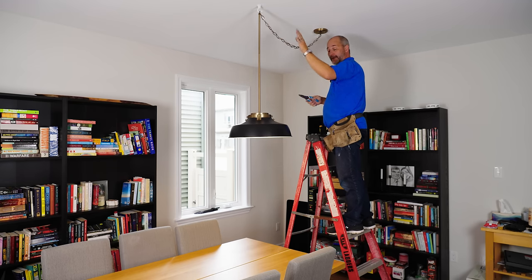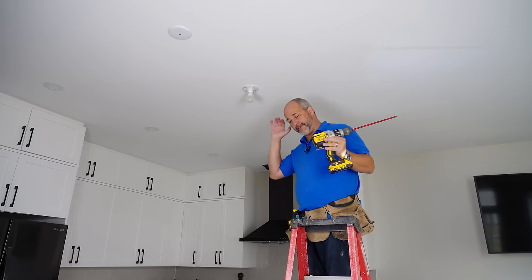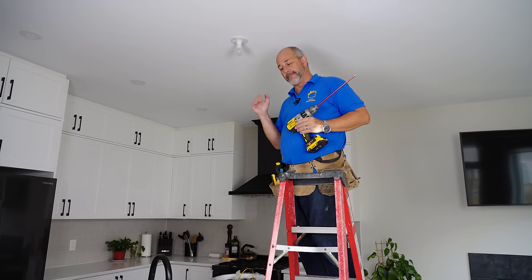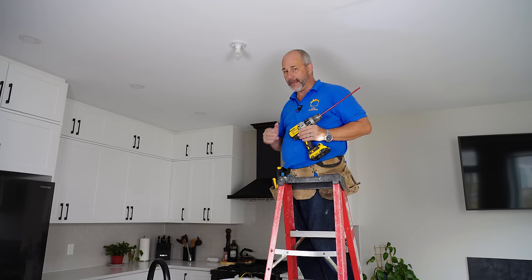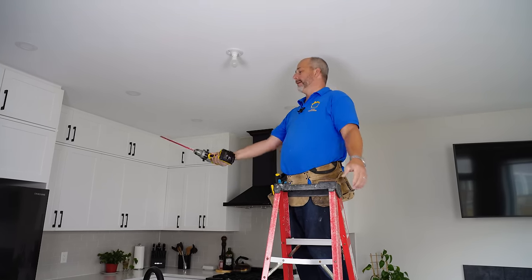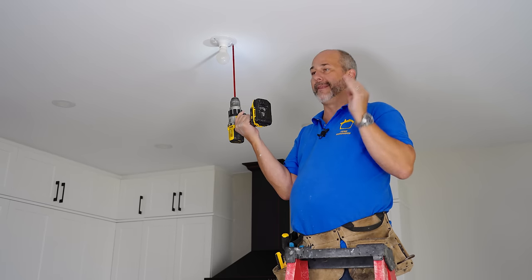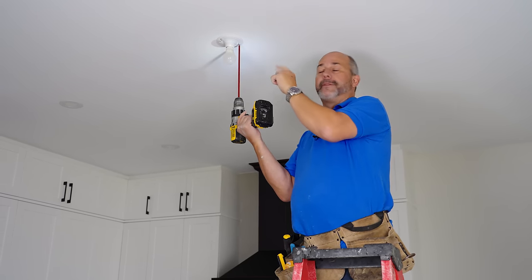We're also going to hang a chandelier center of the table, away from the original light fixture. Quick note: if you're working above a kitchen island, do not step on the overhang — it's not designed for human weight. They build these to carry your plate and a glass of wine, not a person. When taking off your light fixture, there's basically one rule: almost every light in North America is screwed to an octagon box in the ceiling.